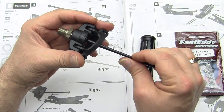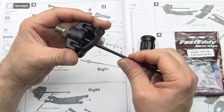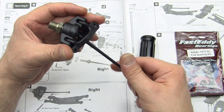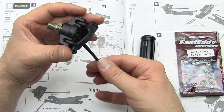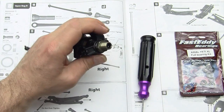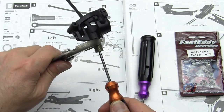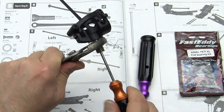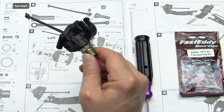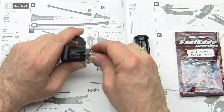Tighten that back up. I'm going to go ahead and swivel this. When I tighten it up, it's actually too tight. It's not easily turning. I'm just putting light pressure on and it's not turning, which means that it's binding up. So we're going to take 1 shim out. And shimming is a process, and it does take time, but it's worth it.